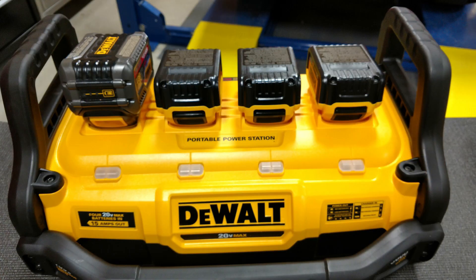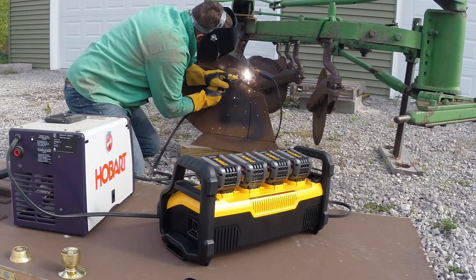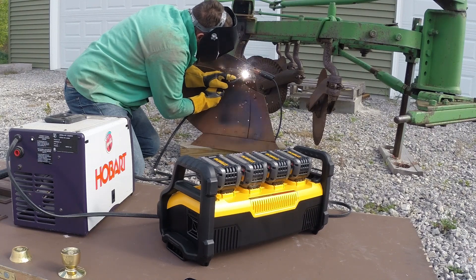You're fine to use this with any of your variable speed power tools, no issue. This unit is available as a bare tool or in a kit. One of the more popular kits includes one flex volt battery and three four amp-hour batteries. But this unit is only as strong as its weakest link — that one flex volt battery won't give you more power than four four amp-hour batteries. The smallest or least charged battery determines how long everything runs.